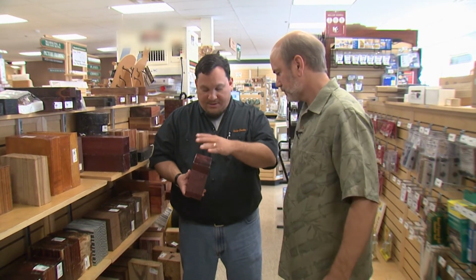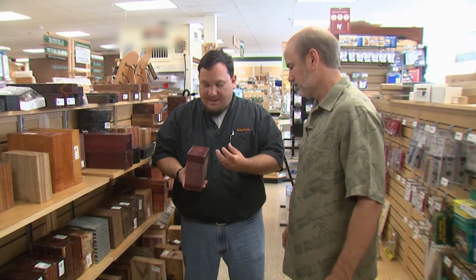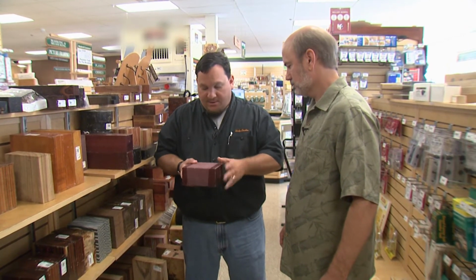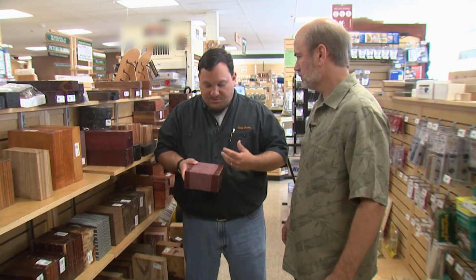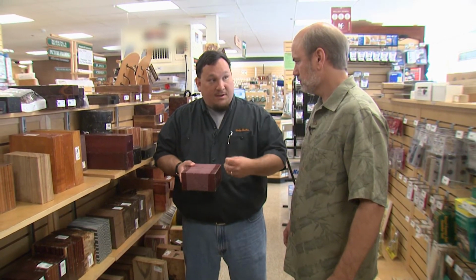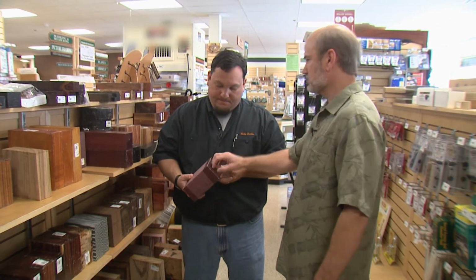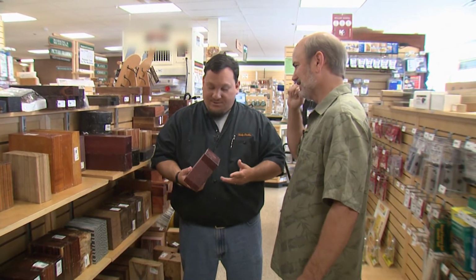Right. You know, the end grain of wood is much like straws. And the wood just wants to really escape through there really fast. And through the side, it'll just allow that humidity and allow that adjustment to where it's going across the country to be an even transition. Right, so it just slowly comes out here, but if this wasn't waxed, it would just come out real fast and too fast, and you would end up with a cracked piece of wood.